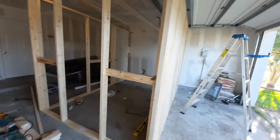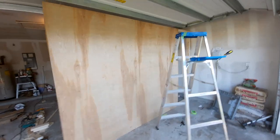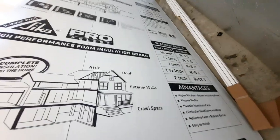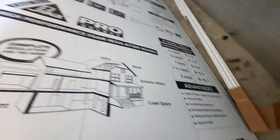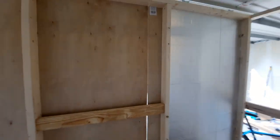We made a lot of progress. All three walls are up. Got the roof joists in — the garage does clear it — and the walls are currently going on. Next stop is insulation. I'm using three-quarter inch R5 rated sheet insulation board and it cuts pretty easy and fits right into the studs. You can see I have the wall done on the outside of the panel and then the insulation board. I'll probably do some foam injector seal right there just to really tighten it up. Really happy with that insulation — it fits and installs very easily.